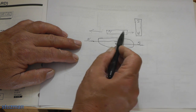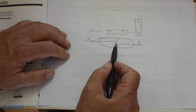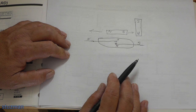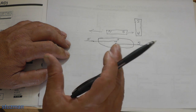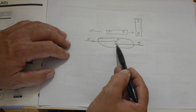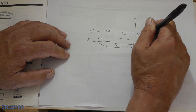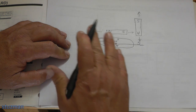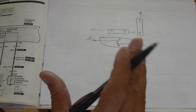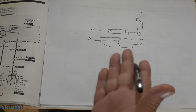The magnetic field configuration of where the magnet is perpendicular will create what they call lobes or active zones around the reed switch - sometimes three lobes or four lobes. If the magnet is placed parallel to the reed switch and moved in a certain direction, you get different operating parameters for when the contacts open and close. Passing the magnet across, the contacts could open and close three times because it's passing through three active lobes. There's also a dropout lobe where you go outside the lobes and the contacts will open.